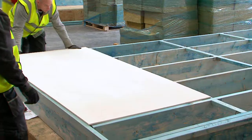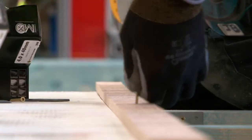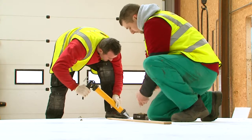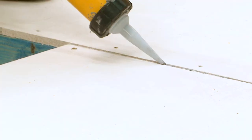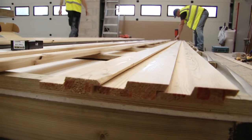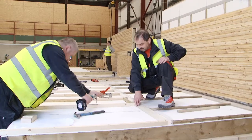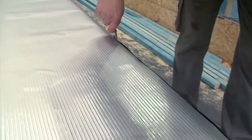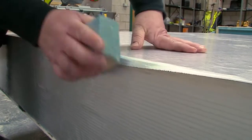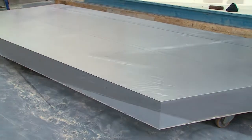The cassette panels are assembled by skilled joiners using high-performance screw fixings, which allows for easy repair should it be required. The cassette panel frame is then closed off and encased with a highly advanced building board that provides racking strength and a seamless fixing point for any external or internal cladding profile, meaning the thermal integrity of the overall construction is not compromised by fixings or fastenings. The panels have also been weather tested without an external finish to allow cladding to be installed later in the build program, offering additional flexibility.